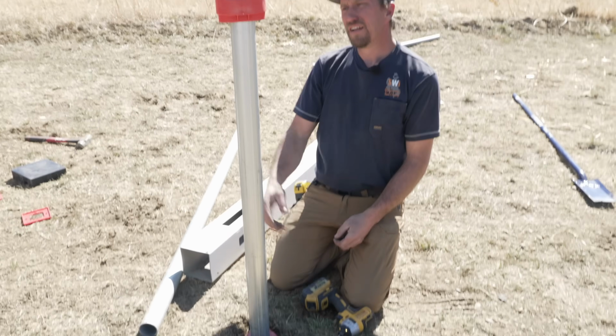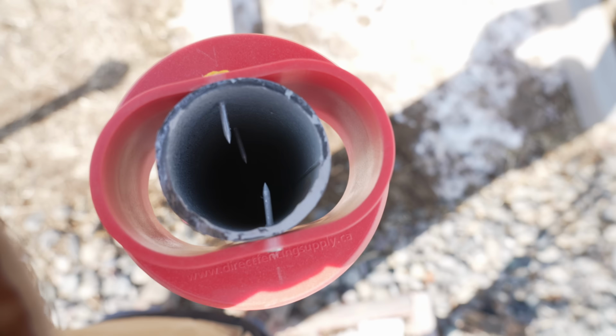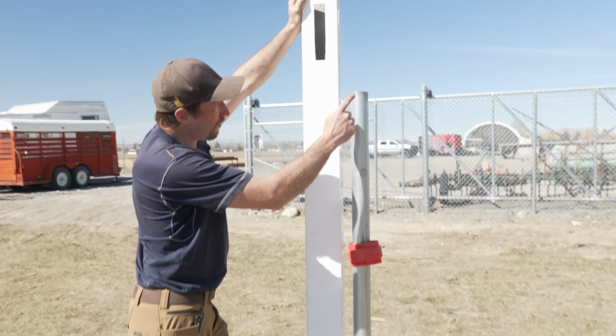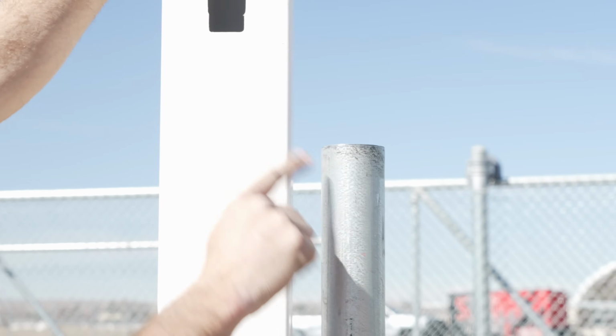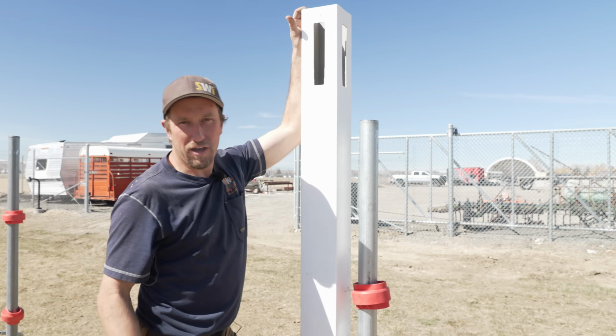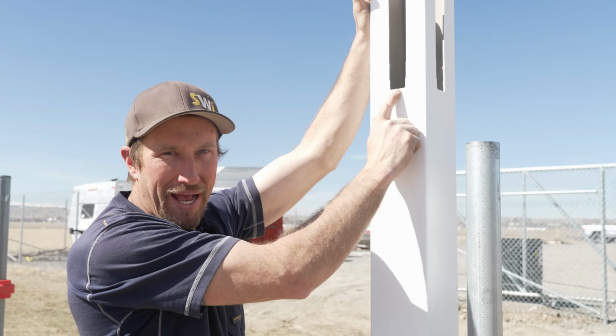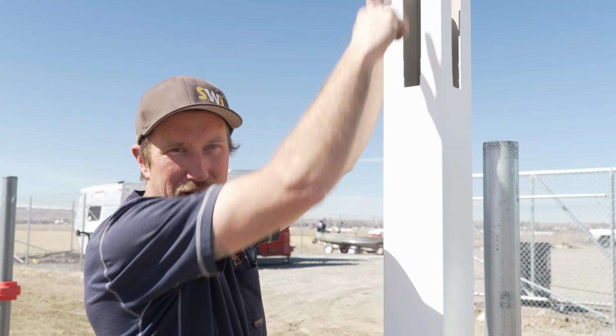And also, along with that, if you have a cordless concrete nailer, you can do that as well. So you don't want your metal post to go above here so that way you can get your rail through, and then you can get your rail lock on as soon as your fence is built. So you wanna make sure that your post never goes past this into the hole.